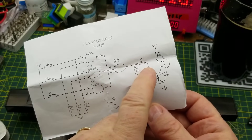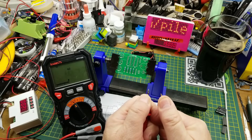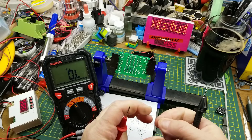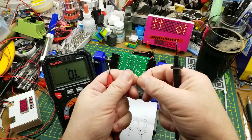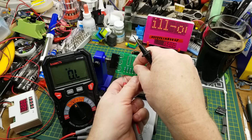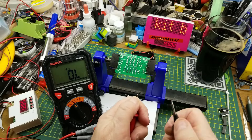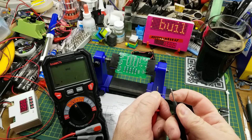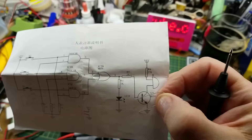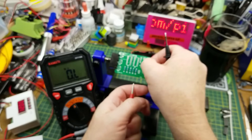Now last week I completely broke that rule because I started with the surface mount stuff - that's the lowest profile, but a lot of it was silicon. In this case we're definitely starting with the least likely to be damaged low-profile stuff. R5 is the 2K. Those of you who have the luxury of not being colorblind could just read the bands off. These little blue resistors are really, really hard to read the color bands on, even if I could see the colors properly.